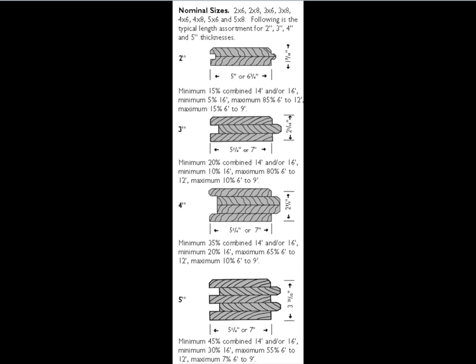These are what we call one-inch boards. Nominally they are cut close to one inch, then dried in a kiln or air-dried, and then planed down. For example, the nominal three-inch laminated decking is basically two and three-sixteenths inches by the time we are done, because these boards are planed down to about three-quarters of an inch thick. They are laminated together and then planed again. You'll notice they are offset relative to each other to produce a tongue and groove effect.